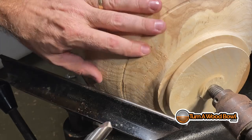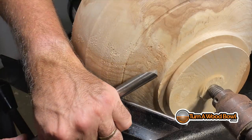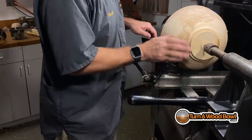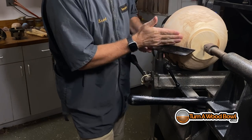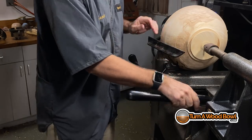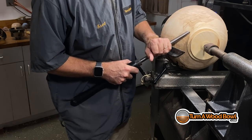This cut is really used for refining. You're not going to want to use this to rough out a bowl — you'll use this cut to refine the surface of a bowl. Normally we keep the tool rest close to the surface of the bowl blank, but when we're doing a shear scrape we pull the tool rest back a bit to get more of a 90-degree supported angle with the tool. The tool is going to be up a little bit higher than center and that's fine.